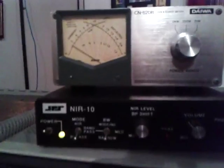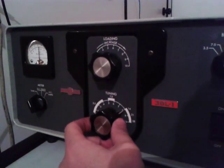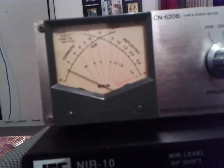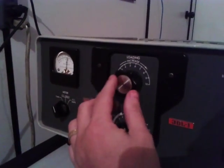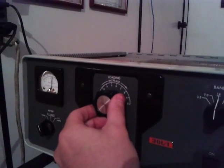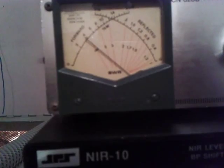With 30 watts, we can see how much power we're going to get with the 30L1. Now on the scale it will be 2 kilowatts, and I will adjust the tuning button like this — trying to get the highest power output, very slowly. After this, we're going to go to the loading tune button — the loading button — and increase it a little bit.